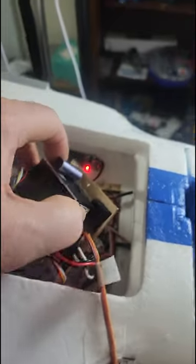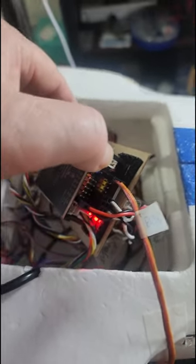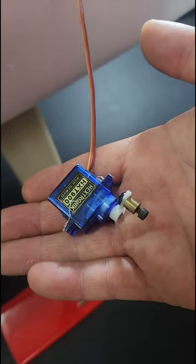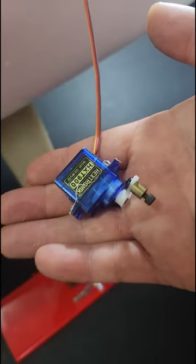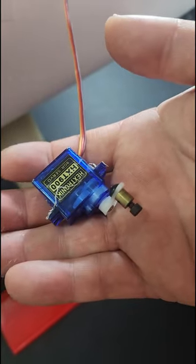It's alive! It's alive! So I've connected the aileron servo to the same output — the one that was fried before — and I've got the power coming into the servo rail up the top here. Look what happened: I'm getting movement, it is moving. So it's alive. It is actually working. The flight controller is okay — I'm just going to have to replace the wires and this will be up and running.